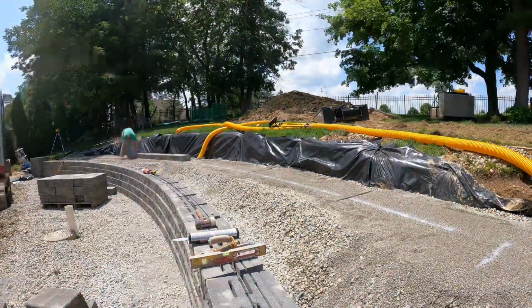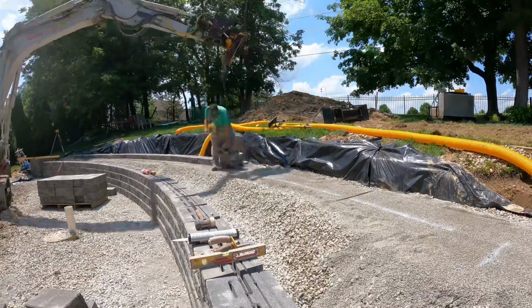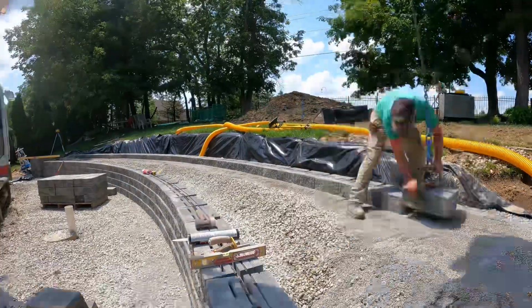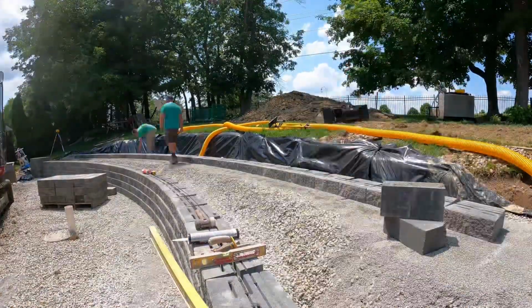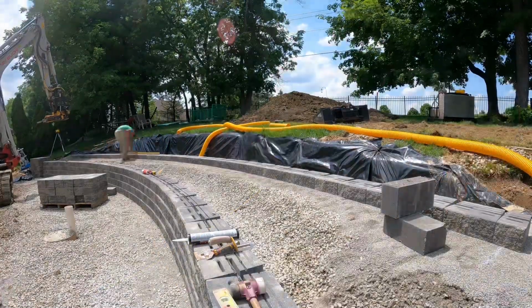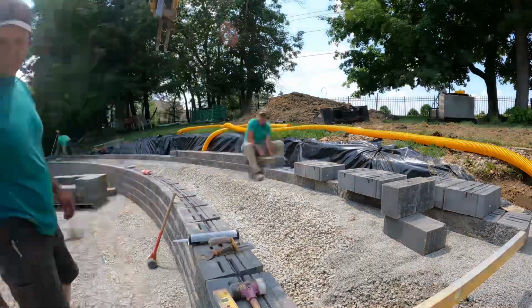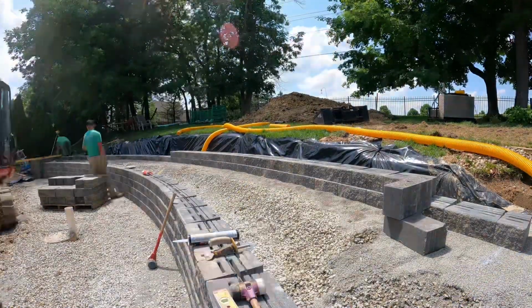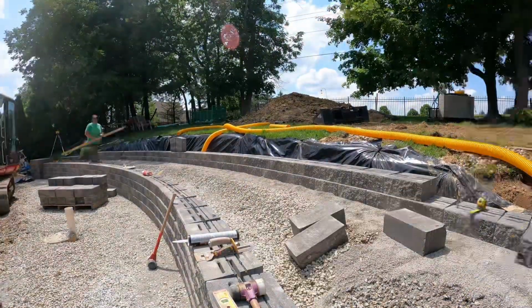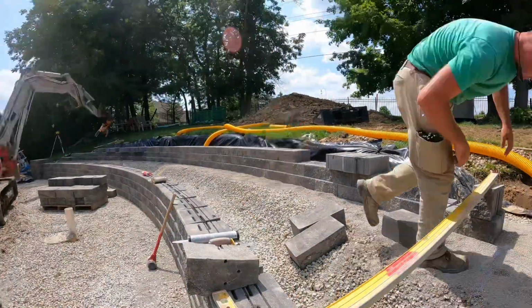There we go. We use the rover to find out where those columns went exactly, which we ended up just lining up with the bottom columns at the same angle and stopping point anyways, but it kind of helped us get set. And checking each one with the radius and then leveling them all out, making sure we were level. Usually it's just a fine little tap around, not more than a couple hits with a hammer usually to get that base course level.